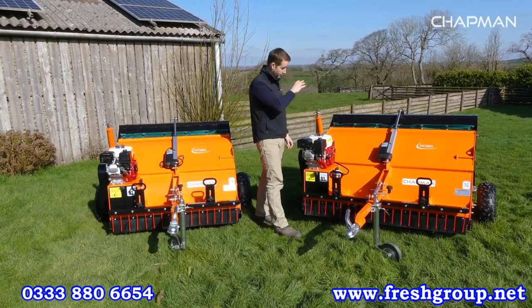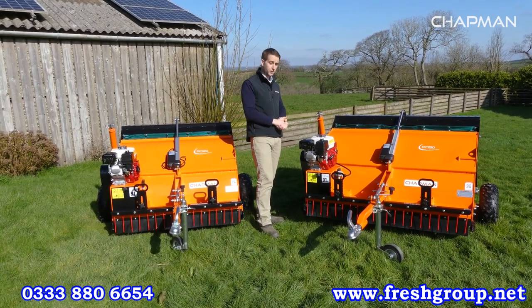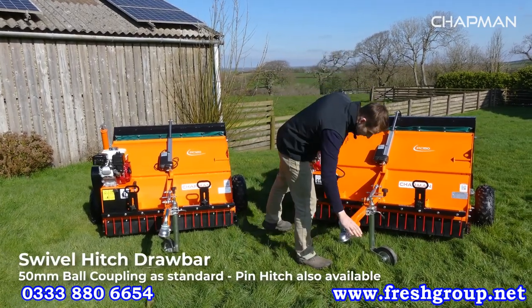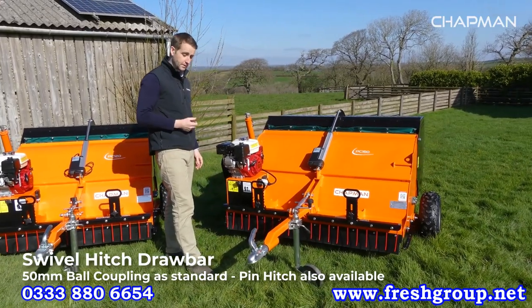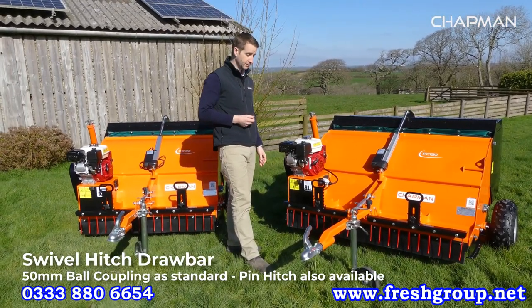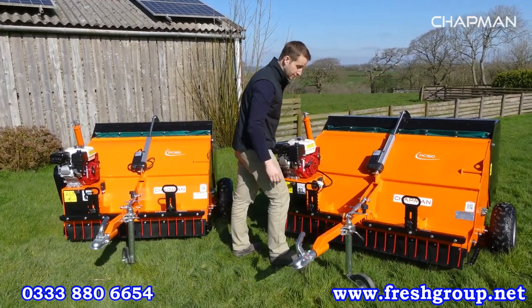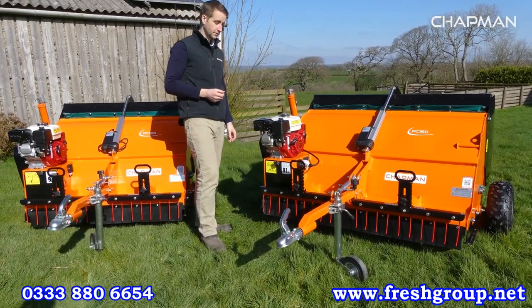What we'll do is we'll go through the PC150, some of the features and benefits, why it is a great machine for you. So, starting at the front, you've got a standard 50mm ball coupling with a swivel drawbar on there to allow for undulating ground. We can also supply it with a pin hitch as well. Moving back from that, jockey wheel for hitching and unhitching, and also the drawbar is height adjustable to allow for a range of towing vehicles.